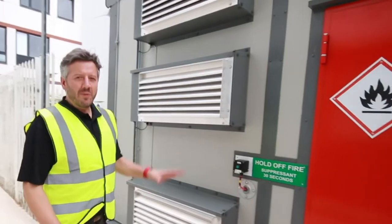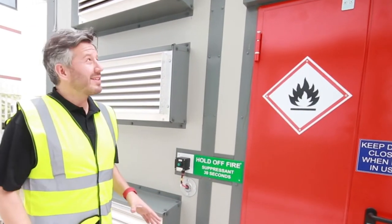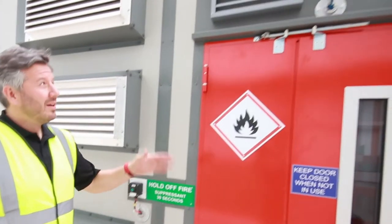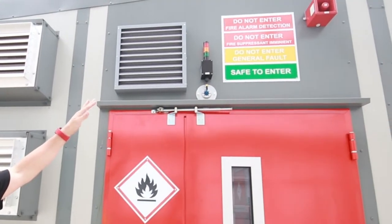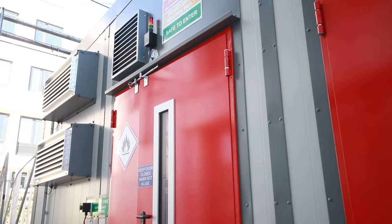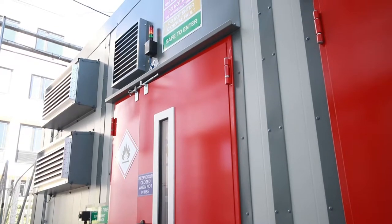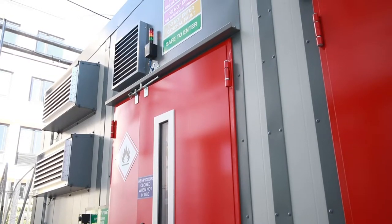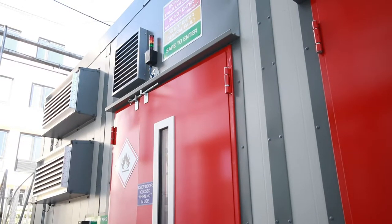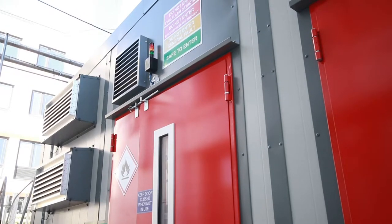I'll show you around. We've got a smart system in operation here to tell the operators if the store is safe to approach or if there's a hazard in progress and they need to keep away. Up above the entry door, we've got a simple traffic light system. The green light means the store is operating safely and it's good to use. The amber light means there's a general fault or a lone worker alarm has been activated and they're not to approach the store. And the red light there indicates there's a fire alarm situation in progress and definitely don't enter